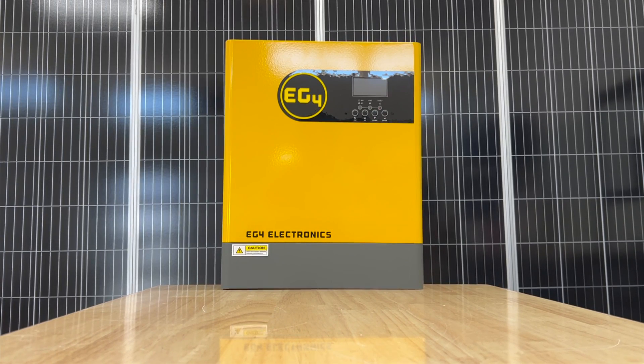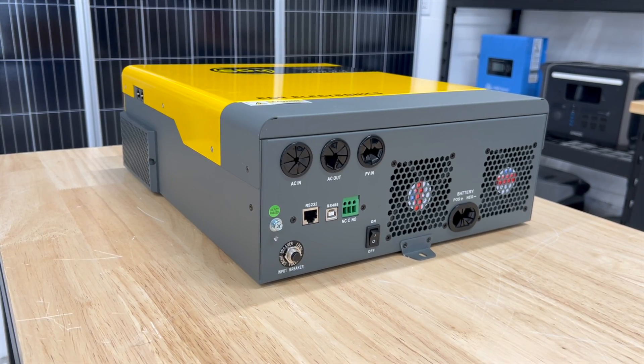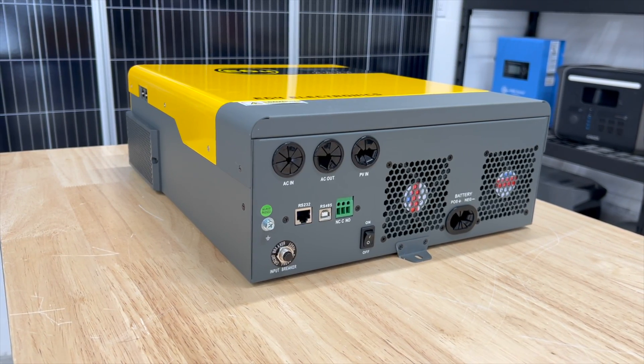When it comes to the input number, that's going to be your solar panel sizing. We determined we want a 2,500 watt solar panel array, and we actually found an inverter on EG4's website that does the 3,000 watt output we need and has a 5,000 watt solar input — which is double what we need. But it's perfect because if we ever decide to expand the system, we have so much room to grow and we don't need to get a new inverter.